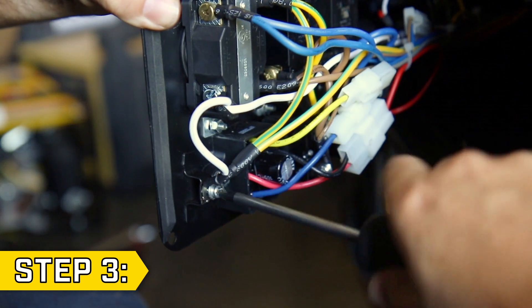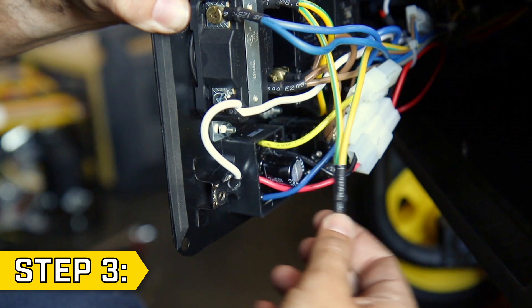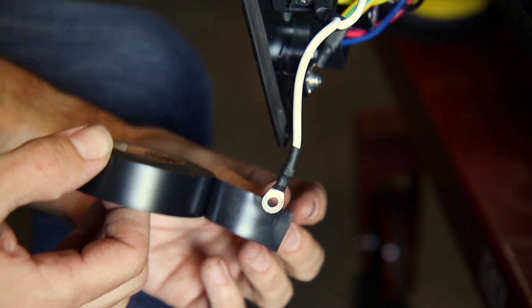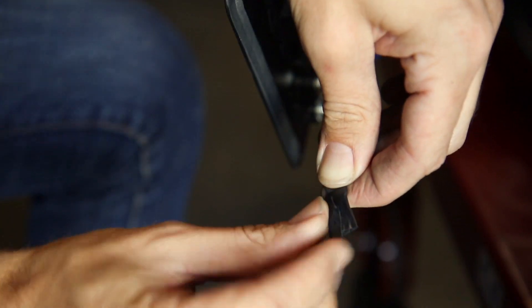Step 3: The white and green-yellow wires are connected to the panel to bond the neutral. With a Phillips screwdriver, remove only the white wire and leave the green-yellow wire in place. Completely cover the end of the white wire with electrical tape, so it won't come into contact with anything else behind the panel.